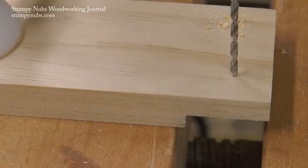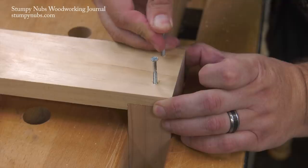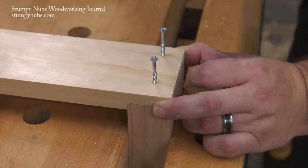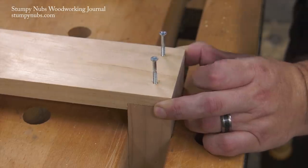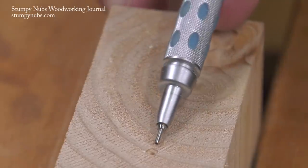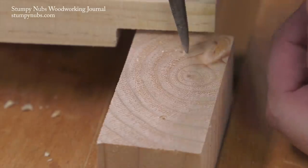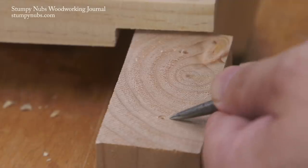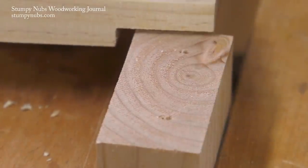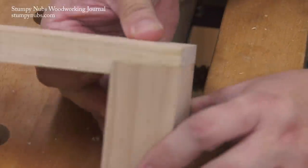Here's how to do that with offset screwing. I bore the larger hole in the upper workpiece first this time. Then I slip the screws into the holes, align my workpiece on top of the mating workpiece, and use the points of the screws to mark light impressions in that lower workpiece. Then I disassemble the joint and use an awl to mark new impressions on the opposite side of those first little dimples from where the shoulder of the joint will be. Now when I drive my screws, it will pull that joint together tightly in both directions.